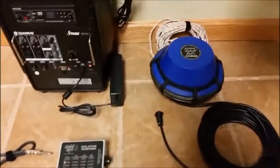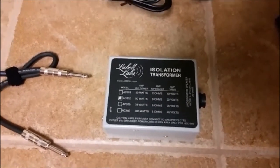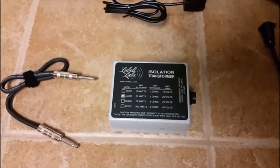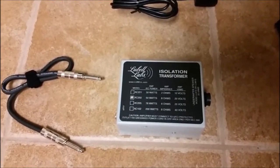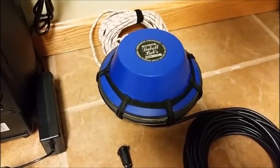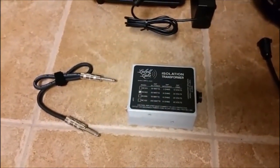Although the cage-mounted speaker is a lot more rugged. Here are the components of the system: the speaker EC 202 isolation transformer box. It's got an isolation transformer for safety, a heavy power resistor inside, and a tuned inductance in the circuit to match the underwater speaker, which is a sonar-type speaker for broadband high-fidelity use. You always want to use the transformer box with the speaker and the amplifier.